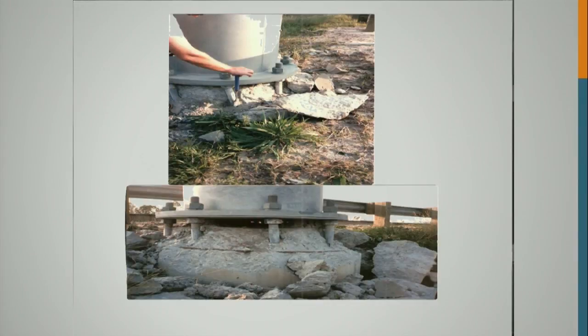It rotated the sign, but out of the 13 damaged bases, they had 3 or 4 that they replaced down toward the foundation. The rest of them, they were able to repair at the base, but they had 135-mile-an-hour sustained winds in that hurricane. These 2 sign pictures here were 45-foot cantilevers out at the airport where the wind was sustained at 135 miles an hour. They never lost the first cantilever. And these were all grade 36 bolts, 8 to 10 bolts per pedestal. None of them fell. So I think that says a lot for redundancy. Yep, redundancy and more, the better.